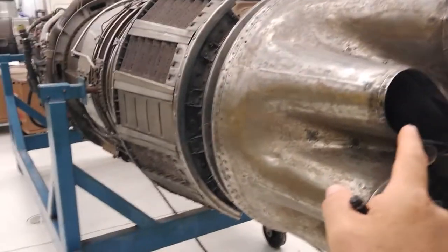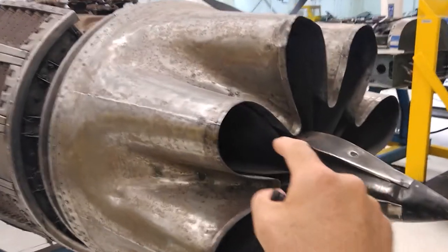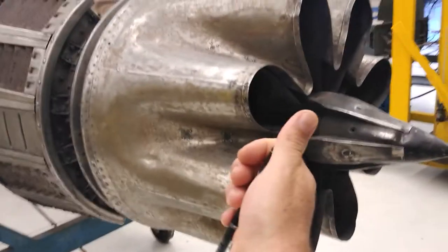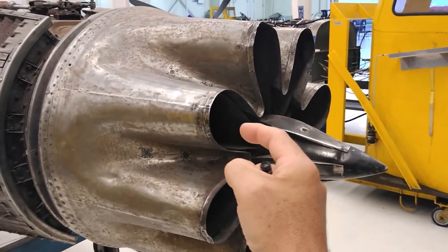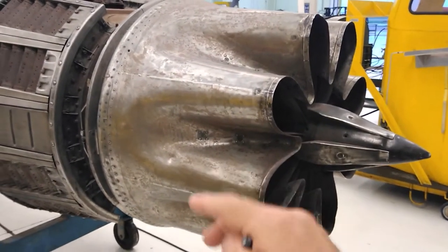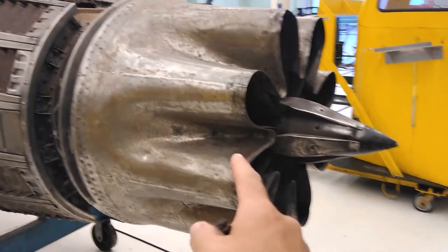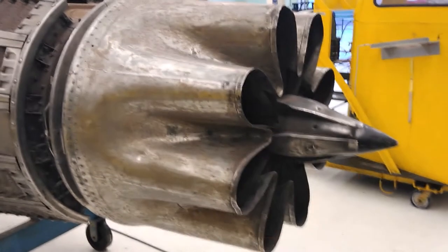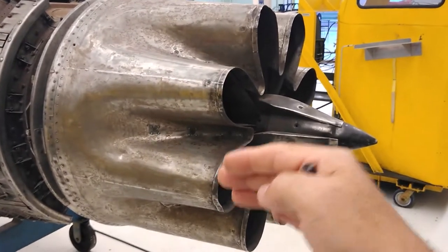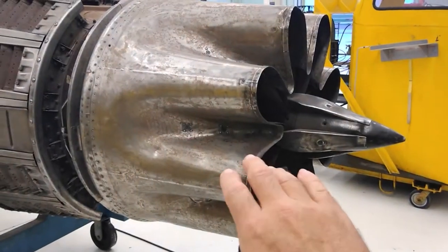The way it does that is by mixing and diffusing the exhaust. This is hot, very fast-moving air screaming out the back of the engine, mixing up with the still, ambient air around the outside. The boundary between those two layers of air gets very turbulent — that is where the loud exhaust noise comes from, associated with pure jet, old-style fighter jet engines.